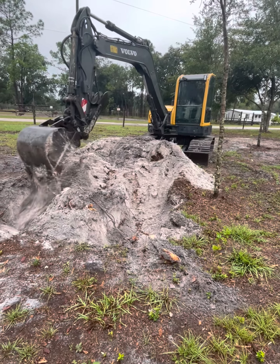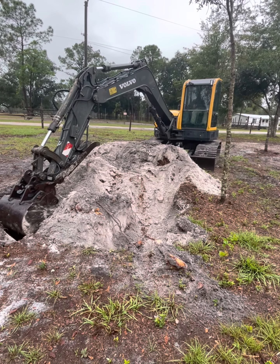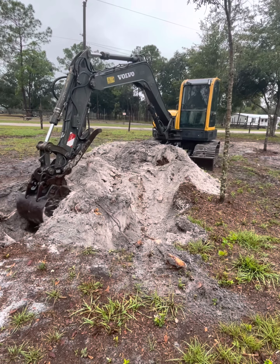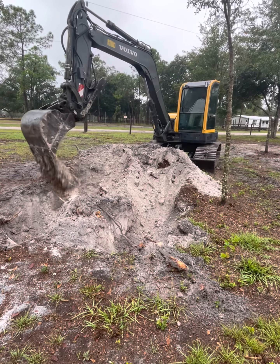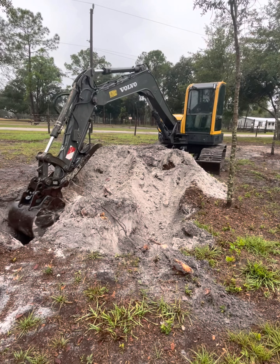When we're checking the stump, he'll give it a quick half-second pull. If you don't see some movement — like right there, he backed off of it some, was able to get moved, got the dirt out of the bucket, and was able to pull through that root. But if you don't get some movement pretty quick, you better back off of it, especially if your machine's got any kind of age on it, because that's when you have a failure.